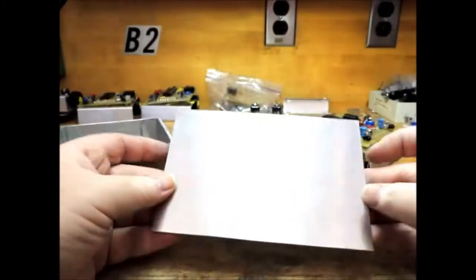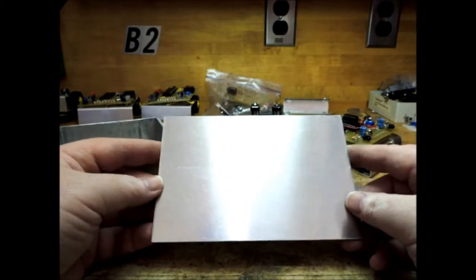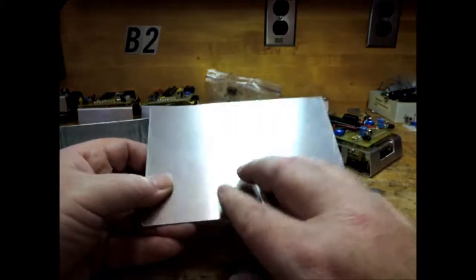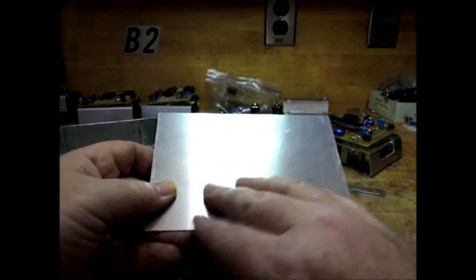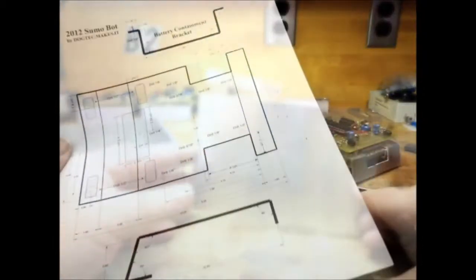There's a tendency to stop filing once it kind of fits snugly in the box, but because we have to make a bend in it, it could end up being bent at an angle and not fitting. So it's better to make sure it is loose in the box. The aluminum looks fairly shiny because I used the cardboard in the vise — the vise fingers would have pressed against the aluminum, and aluminum being a soft metal, you would have ended up damaging it.